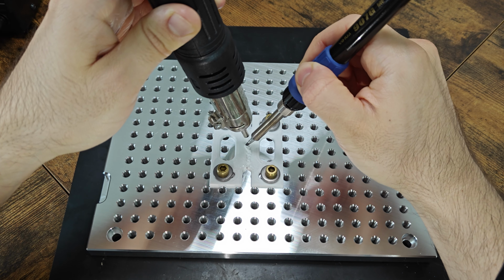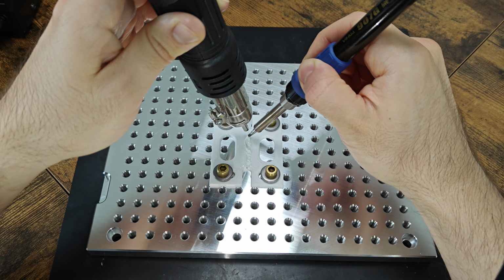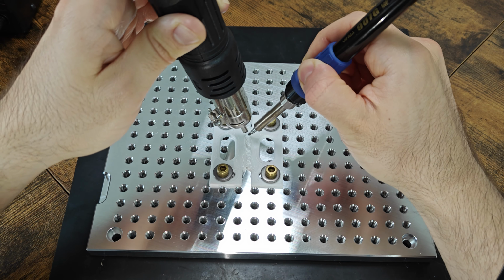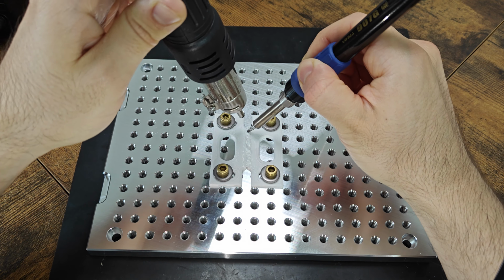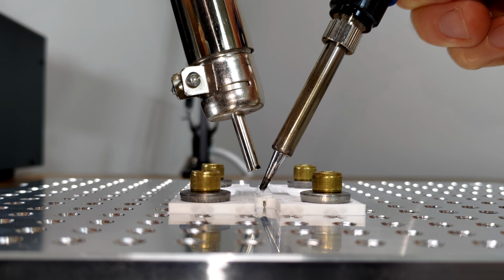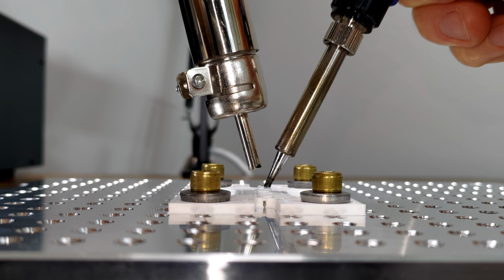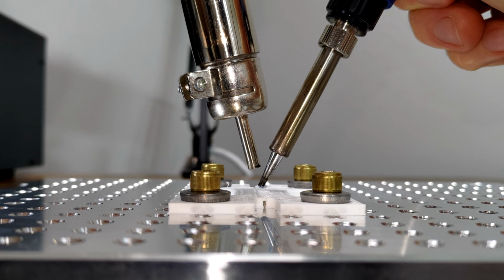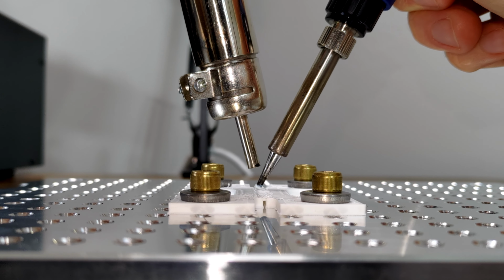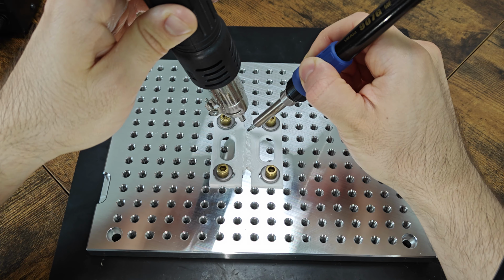You can move as fast as your heat allows, but not so slow that you melt your part into a puddle. This will likely be a slow and tedious process that requires some practice to get right, especially if you don't have any experience with TIG and oxyacetylene welding. Ensure you are incorporating your filler material and mixing together equal parts of both pieces you are welding together. Don't forget to control your heat from the heat gun at the same time. You may need to oscillate the focus of your heat between the filler material and the part.